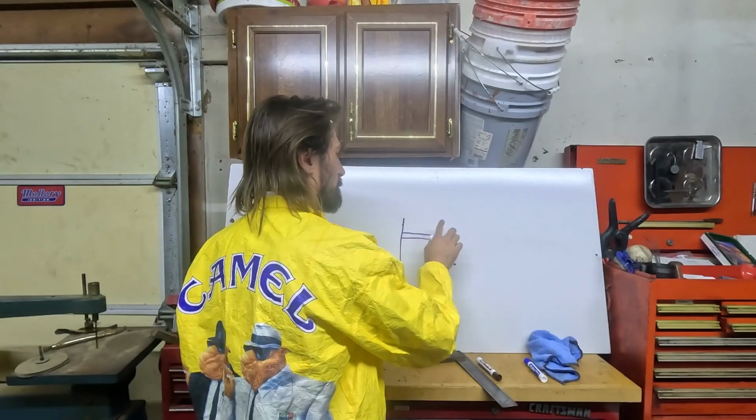There's a few different reasons we would want to do a cantilever. My most useful use for a cantilever is I build a lot of decks. So I'll put a cantilever 2 foot in from the edge of the deck, and that allows my span from the ledger where I'm attached to the house to the beam to be shorter, which allows for less deflection. That's the bouncing and the bow that's going to happen with the weight that's in the middle of the joist.